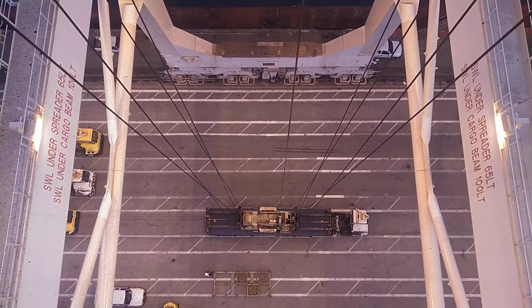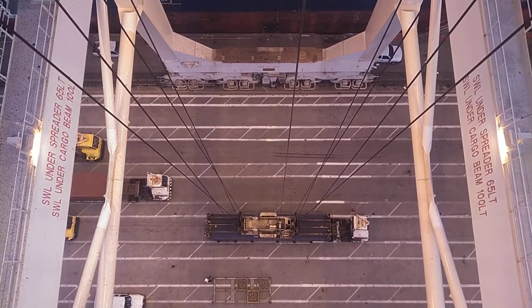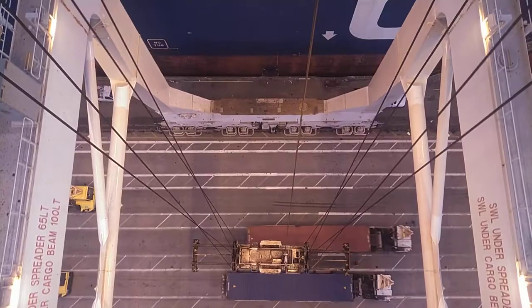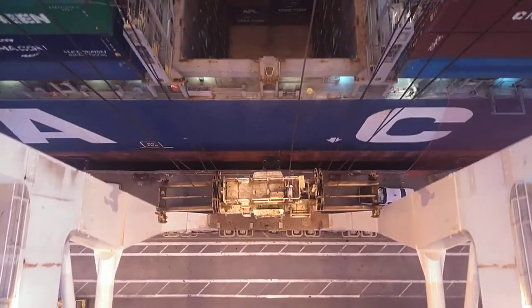What I do is when I come out, like the crane slows down, you start counting. All your operators, your new operators, the old operators should know that already, but your new operators, find out when you come down with a box, you should go into a slowdown mode. You gotta find that out.